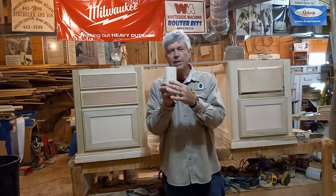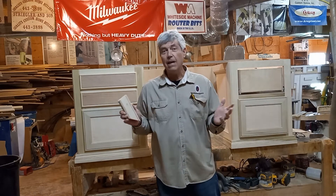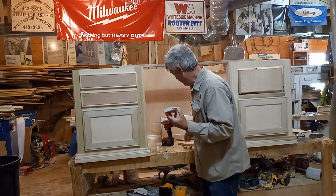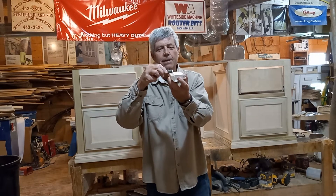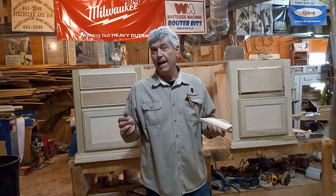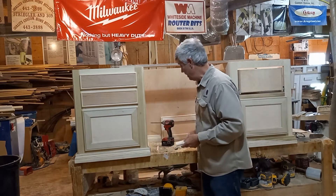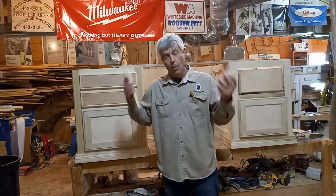Here's a piece of the frame material that I mitered around that piece of plywood. Putting these together is really a lot like putting together a picture frame. If you look at the profile, it's got a bead cut on one side, and on the other side it's got basically just a round-over. This is the beading bit I used to make that cut, and you do have to be really careful to get it nice and accurate — I did have to do a little bit of hand sanding because my routing wasn't perfect. The inside cut is really straightforward; it's basically a quarter-inch radius. Both of these are Whiteside router bits. Go ahead and mill up all your material.